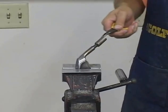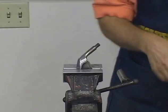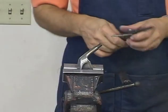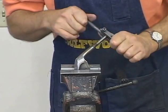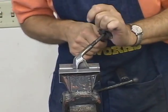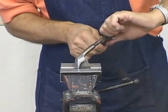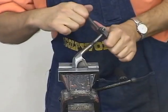So we had our shaft. We haven't got it yet, but we got it coming out of there. But it got to the point where the shaft was turning. So possibly at this point, I can come in here and grab it. And it's going to split it a little bit. Grab it with an easy out and get it out. This is a good example. One that's not coming easy.